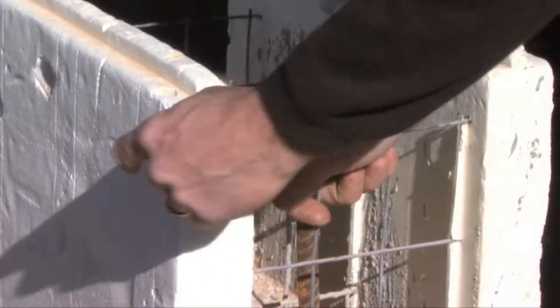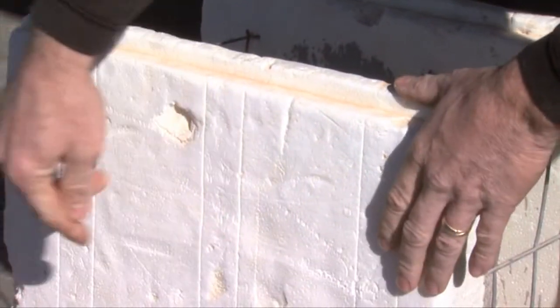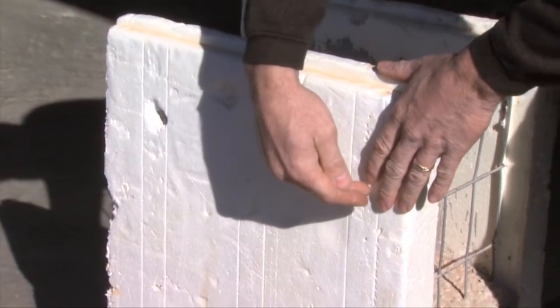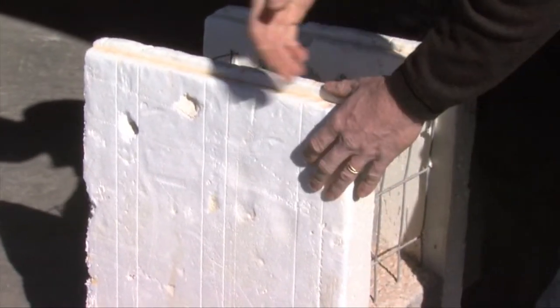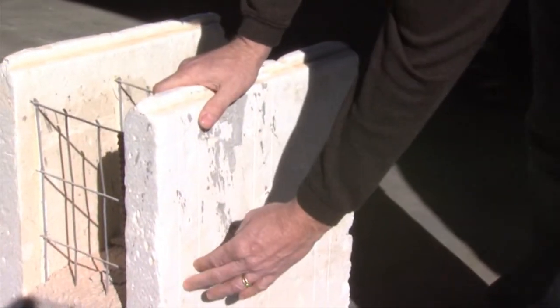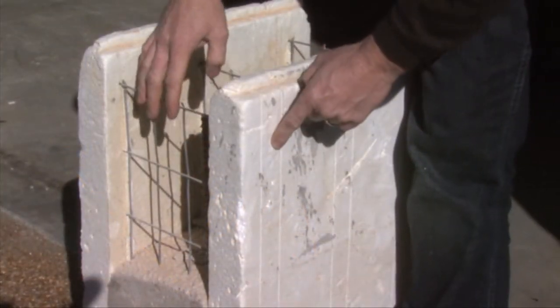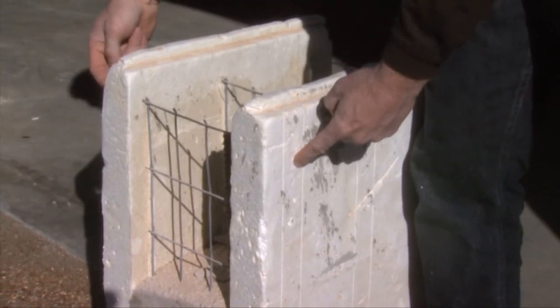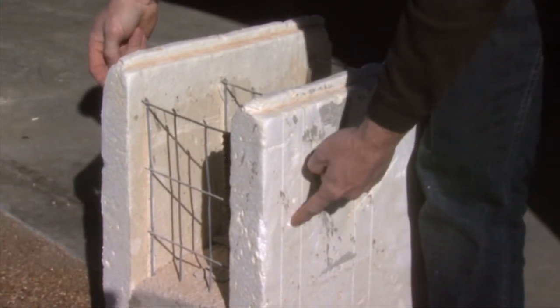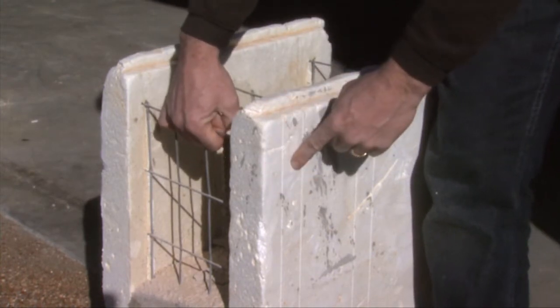This particular form has metal studs on six-inch centers. This is where you can attach your drywall — screw the drywall to it on the inside. On the outside, it's got the same, and you just screw your brick ties to the outside, or vinyl siding, whatever your exterior is going to be. This metal internal rebar is welded from stud to stud all the way through the concrete. When the concrete is poured in, it really gives a strong anchor and a strong wall.